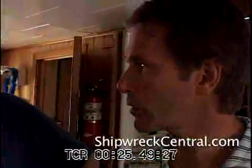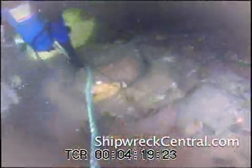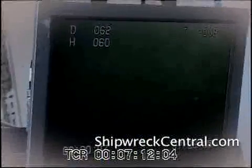That's good, because what we know about the site of the Alexander McComb is that she's standing very high off the seabed, meaning there's going to be a very dynamic structure that will really affect the currents. Imagine a three, four, maybe even five-knot current — you'll get in the lee or protection of some of the superstructure, and that's when we'll want to dial the thrusters down to optimize precision and get the best picture possible. Our operator told me this ROV is state-of-the-art and really the one for the job.